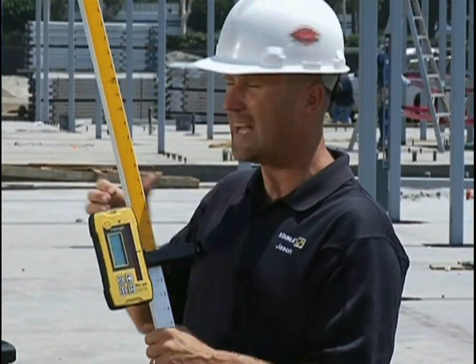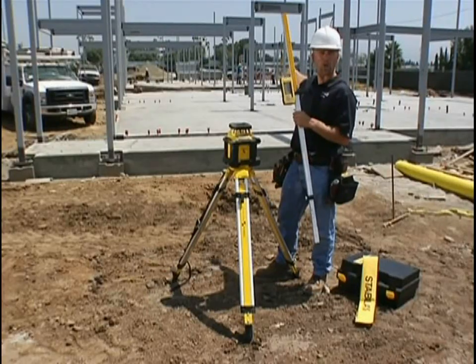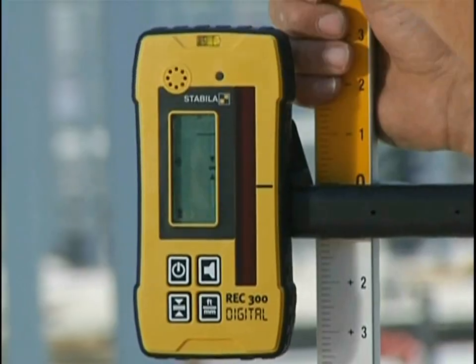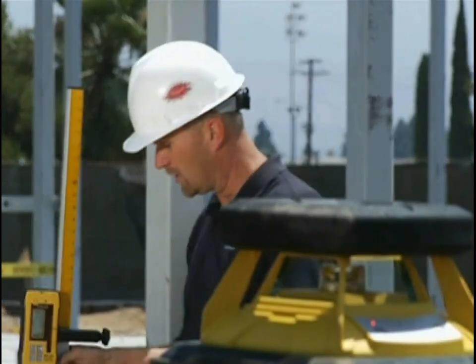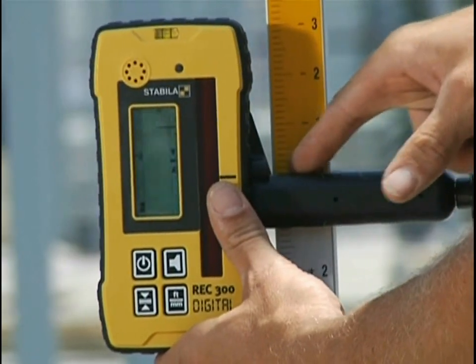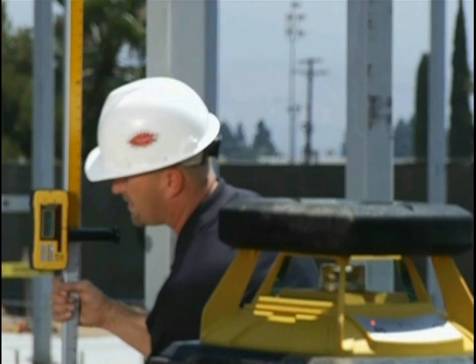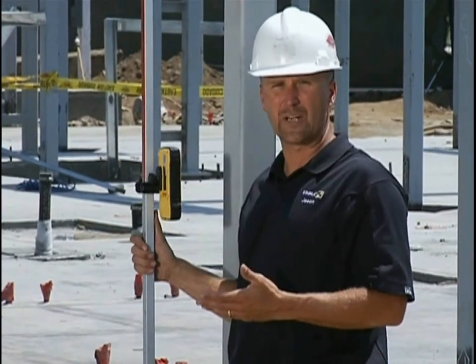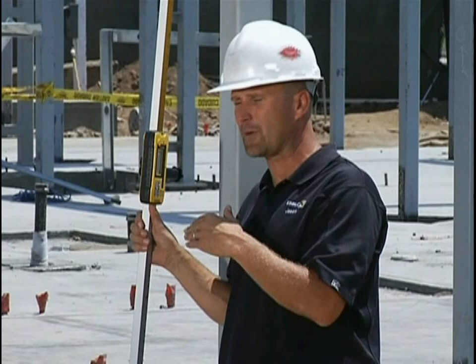Next I'm going to show you this receiver on an actual application. Like I said, this concrete was poured a week ago, but now as the carpenter building steel studs on here, I can go around the perimeter and check how level the concrete is. The first thing I do coming onto this job is adjust the receiver to the height of the laser — I've clamped the receiver onto zero on this grade rod. Next I adjust the height until I hear an even tone, then tighten the clamp. That means I'm even with the laser. Then I walk along this chalk line, set down the receiver at intermittent spots, and it tells me how far from level I am. Watch the screen closely — it's going to change the way we work.